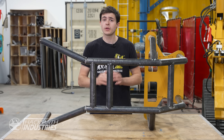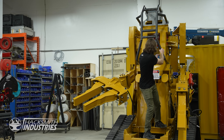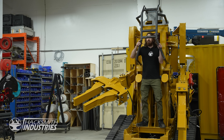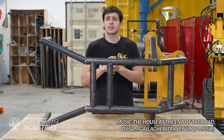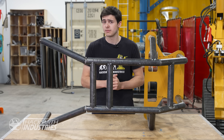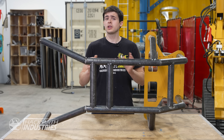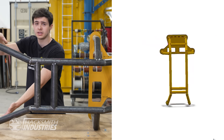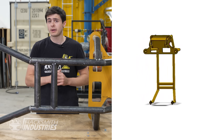In the last episode of the Aliens Power Loader, we built our first prototype of the roll cage. But as you can tell, there were some areas for improvement. After doing a bit of analysis, we realized that the model of the pilot we were using in SOLIDWORKS is actually a little bit taller than me and James, which meant that these two bars were in their field of view. So after doing a little bit of redesign, moving these two bars down and moving these two bars closer, we now have optimal visual and elbow clearance for the pilot.